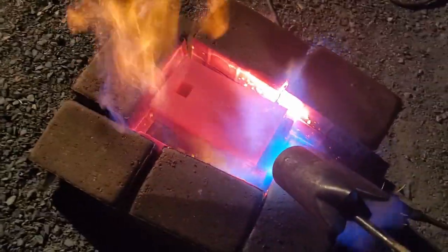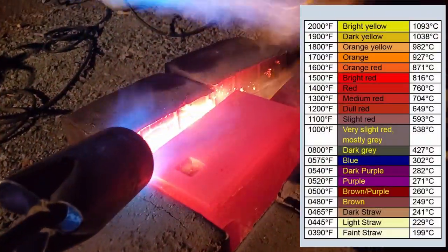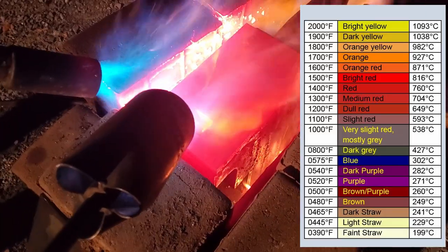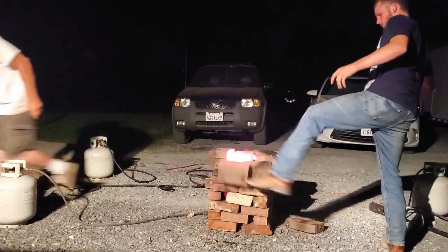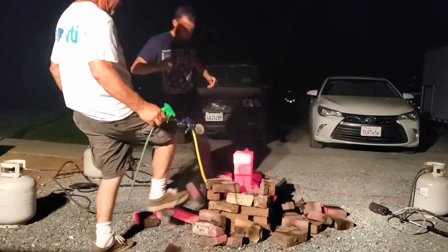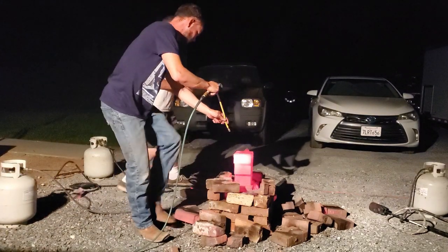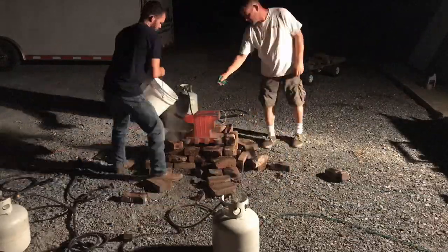The whole thing is a bright pinkish red color but our target was about 1800 degrees, which is a lot hotter. So we kept heating the anvil until it was orange-yellow in color. This steel is A2 on top which means air hardened, which is where we started with the air compressor. But we wanted to ensure it was cooled down quick enough, so we misted the top with water while pouring water on the 4140 horn. We continued this process until it was almost cool enough to touch, then it air hardened the rest of the way down.